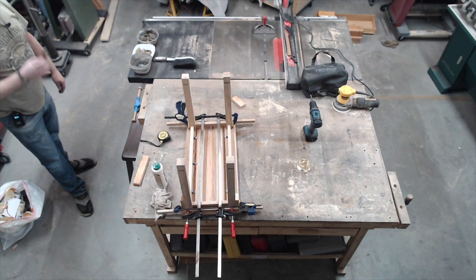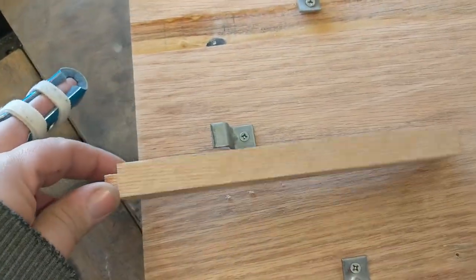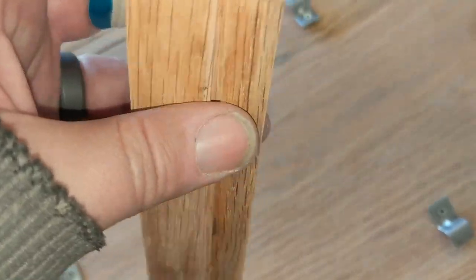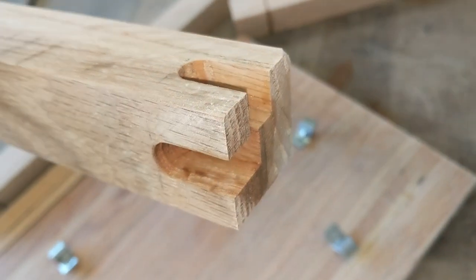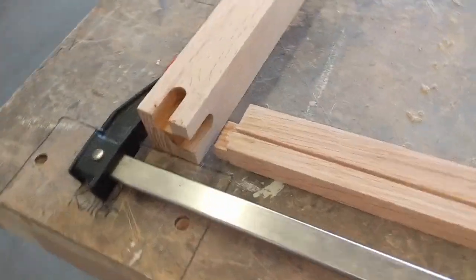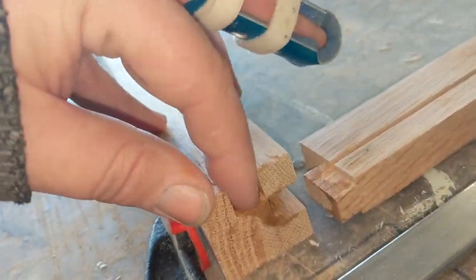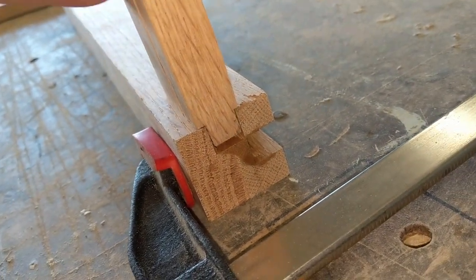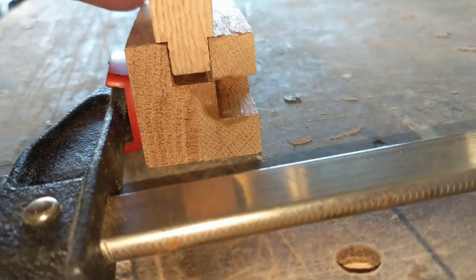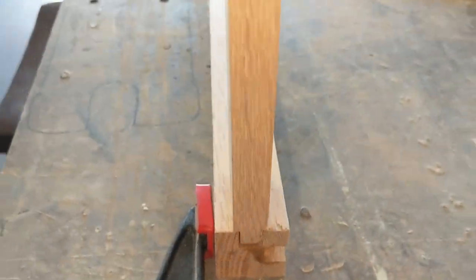All the confidence of the gluing, none of the sticking. The glue either wasn't enough or my measurements were off because it didn't glue at all — you can see the residue of the glue in there. I'm going to clean it up and probably go to my favorite fixer: epoxy resin. I worked out the mistake I'd made — I was so paranoid about not getting glue on the cross members that I only covered the back of the slots. If I pop this in there you'll notice there's a gap, so the glue never actually touched. I really need to cover the whole tenon with glue and slide it in, then clean it up.